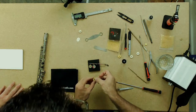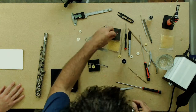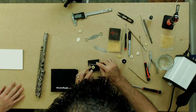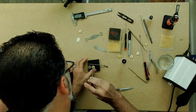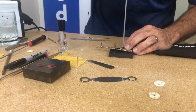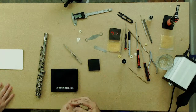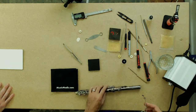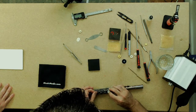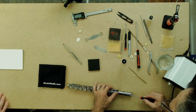At this point, we're going to take the pad and reinstall it. Make sure your pen mark is lined up to the pad arm. Get your screwdriver, put it back together. You don't have to over-tighten — tighten it just enough that it'll hold the pad on there. Don't over-tighten it, because that'll actually squish the pad and make it not flat.